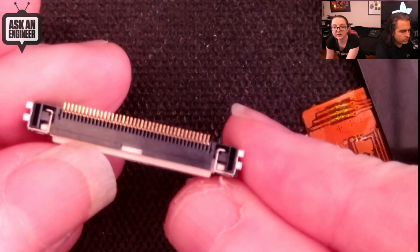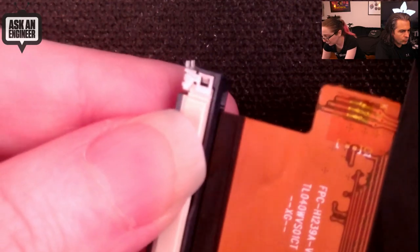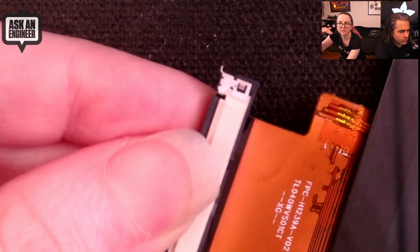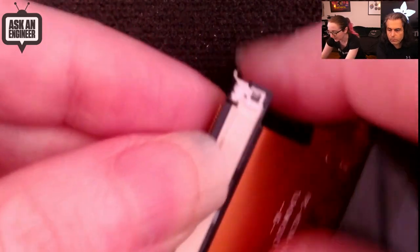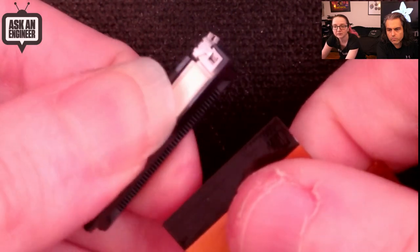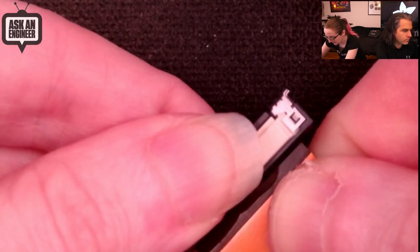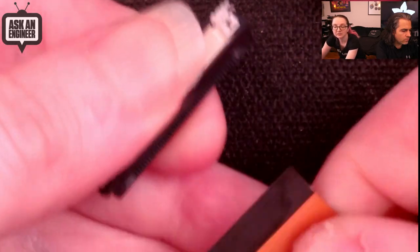You've got the contacts and mechanical strain relief to keep it in place. To plug it in, what's interesting is that you don't push to attach — you just press the cable in. It has a wide curved mouth so you don't have to be careful about alignment; it'll slide in and align properly. It's nicely solid once in. Then if you want to release, you just press the button. You can also press if you want to insert, but you don't have to. So it's inserted — press to release. There you go.